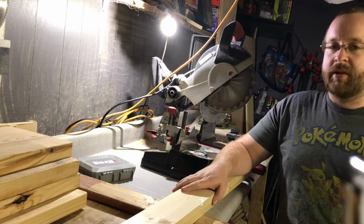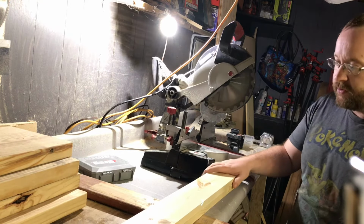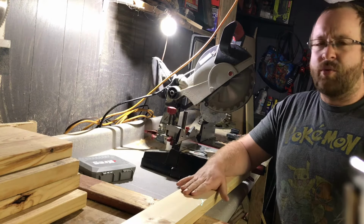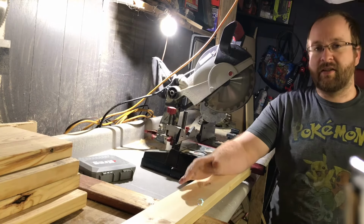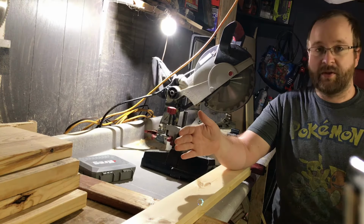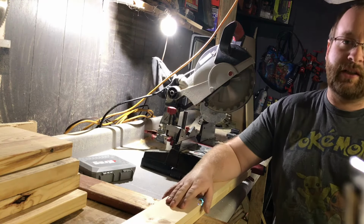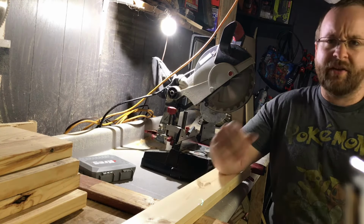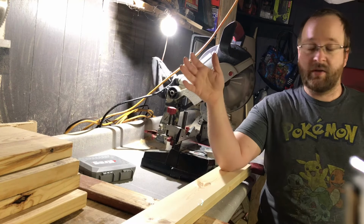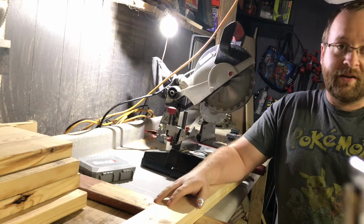First thing we're going to be doing is cutting all the rungs of our ladder out. Each of our four rungs in this ladder is going to be 22.5 inches long. That lets the width of our ladder blanket be 24 inches, 2 feet exactly, and we're going to be right at 6 feet tall on this thing when we are done, okay? This one we're building is going to hold four different quilts or blankets. So yeah, let's get after it.